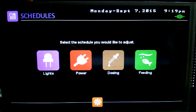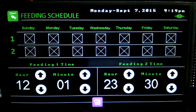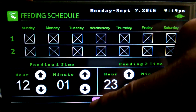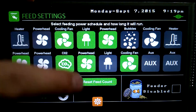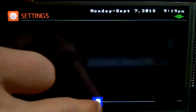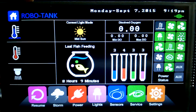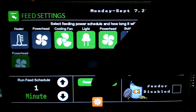There's our camera. Our feeding schedule — right now there's only two schedules per day. What I'm going to do is add a down button and an up button, and when you push that you'll get two more schedules — so it'll have four schedules total for feeding. Speaking of feeding, there's one option that says reset feed count. You don't want to overfeed the fish — in case somebody keeps hitting auto feed, the feeder could run all day and the fish would get fat and die. So it will only feed four times unless you reset the feed count.